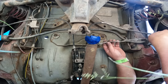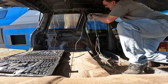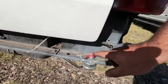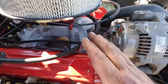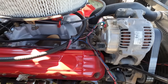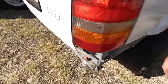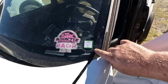The driveshaft stayed secure while we were traveling, so that's a good thing. The driveshaft's going in, pulled out the trailer harness, and I'm going to tie up the excess and get it out of the way. I almost passed tech inspection — the only thing they didn't like was my battery disconnect didn't kill the engine. Easy fix: we're just going to disconnect the alternator. I taped the pigtail to a rubber hose so it can't touch anything, but I can hook it back up if I need to charge the battery when I'm not racing. The initial advance is a little high, it's hard to start, but it's running. I passed this time, so it's legal. Let's go try it out.